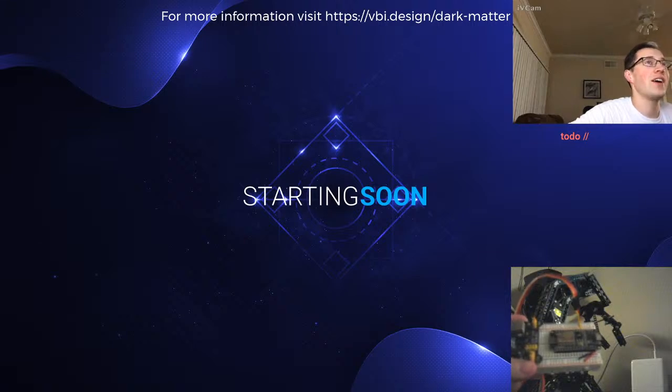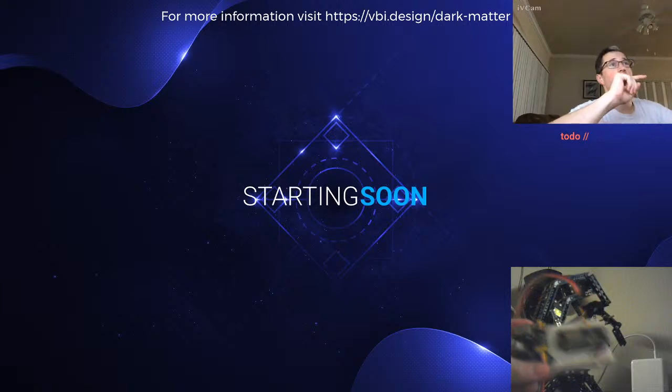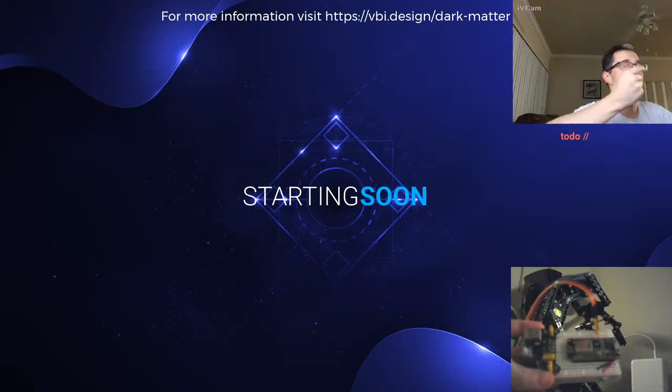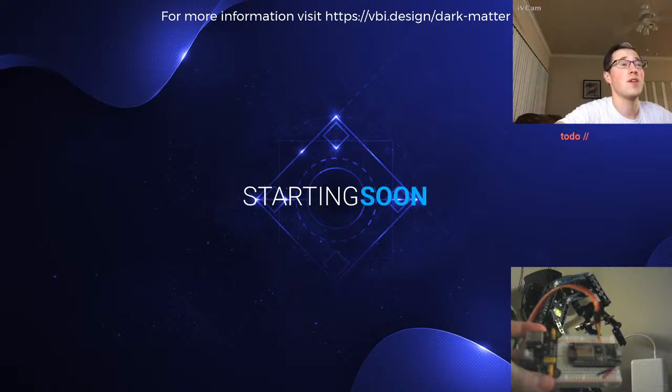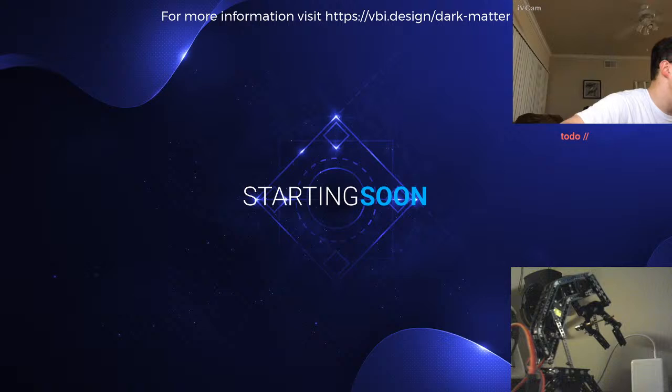Currently, how I have it set up is, I'm testing right now with a phone. You connect to it, it loads a browser, and then from there you have X, Y, and Z axis controls. And over WebSockets, when you move the slider, it sends that information in real time to the ESP32 module, and that makes the arm move. So let's power this up and let's test it out.